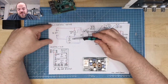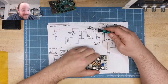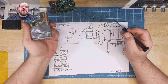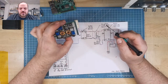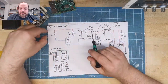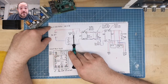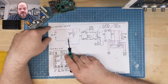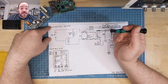So I added two diodes, and this diode is also coming from something else. It's this diode in the TO220 case. It comes from a power supply. I thought it was an AT power supply from a computer or something else. Very useful. So now, when you plug in the DC voltage, it switches on the relay, and I use the negative path because it has a common cathode, of course. Yeah, it has a common cathode, not a common anode.